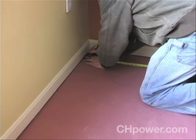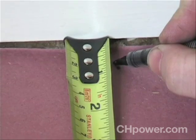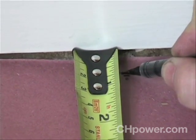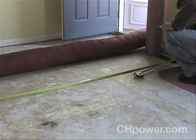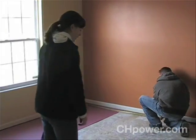If you are laying your floor starting at a wall, be sure to establish a baseline that leaves a 1/2 inch gap between the board and your wall. If you do not do this step, the boards will buckle as they expand and contract. If you are starting at a wall, follow the same steps from starting in the center of the room. Then measure out from the center baseline equal distances to your wall baseline.